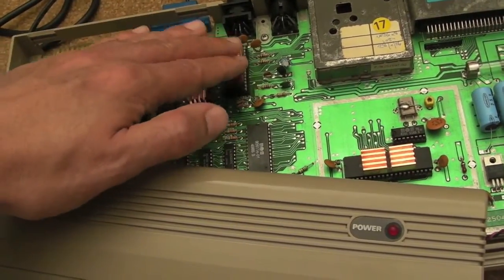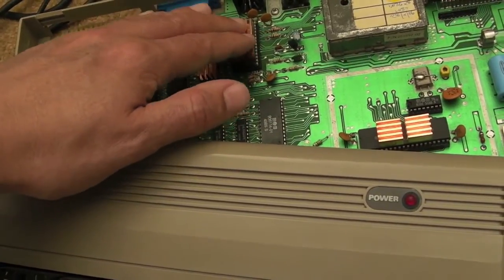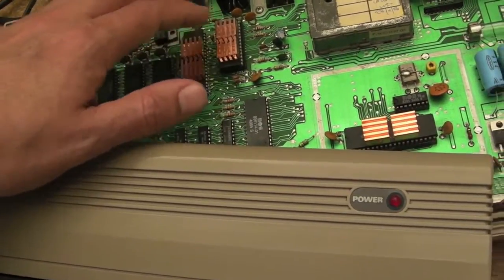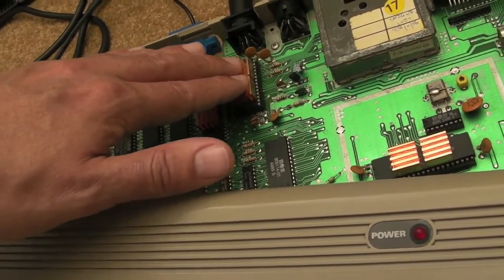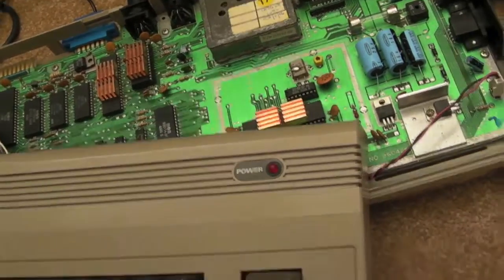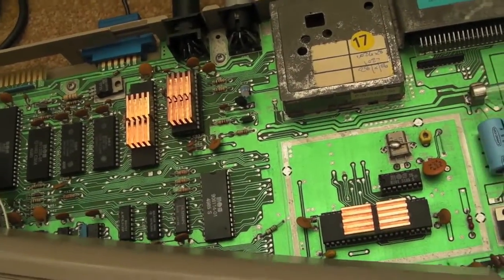So it's a bit annoying. It makes me feel like someone probably sold this knowing that the SID chip was like that, because there was a lot of SID stuff on the SD card — loads of SID players, tons of SID music. It just looks like somebody who had a fascination with SID, and they would know that. I can't help but feel they've sold it knowing the SID chip's on its way out — let's just flog it. So you've got to be careful with these things. You can buy Commodore 64s described as 100% working, but until you actually start listening to it, looking at the picture, and testing it for reliability, you don't really know what you're getting. These are analogue things that degrade. Before I reassemble, I'm going to test some of these VIC chips and mark them up — nothing else is really socketed apart from the SID and the VIC, so I really don't want to start desoldering chips. Anyway, I thought you found it interesting. Thanks for watching — I'll see you soon.